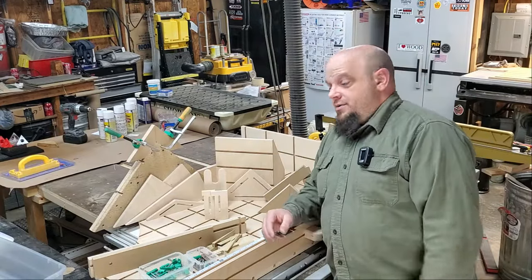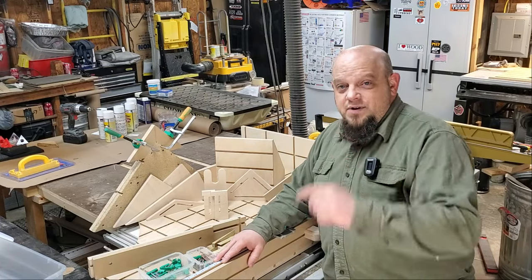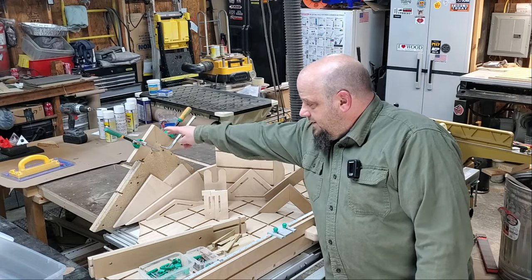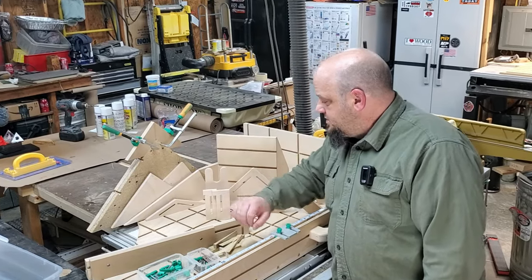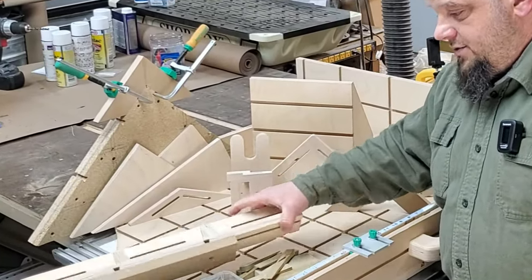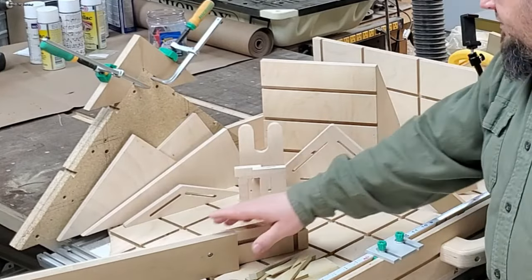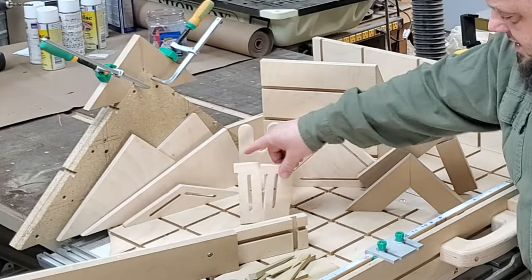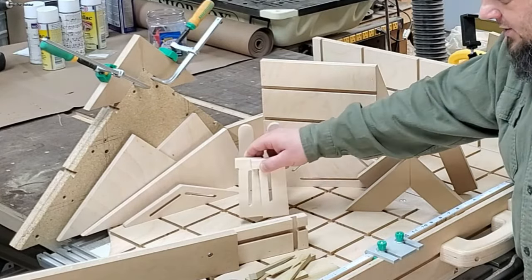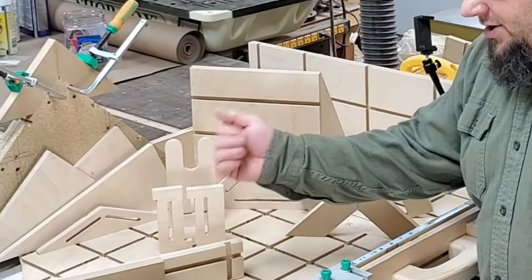All right, so there you go. This is just some of the things that I've done to my sled since we last talked. You've got different angle jigs here for creating miters or different types of angles or tapers. I've built a fence, and we've got an auxiliary fence here. It's got several different slots for different hold down capabilities. This thing's fantastic. We have different jigs here for doing these little things that work great for locking in, but they also make great tapers. As you saw, I used that to make a shim jig.